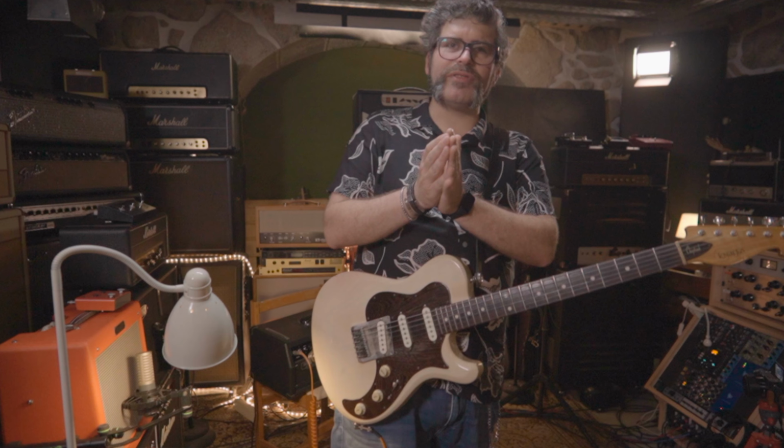So in this episode, we're discussing the importance of power tubes, and mainly there are four types of tubes. There's more, but this is the usual common. For the American style amp, we have the 6L6, that's the broader tube that is present in, for example, a Super Reverb, in a Twin Reverb, on every Fender amp, on a lot of Mesa Boogie amps. It's a very round, bassy, but sparkly tube, so it's a very Fendery tube to my ear.